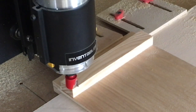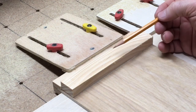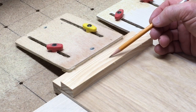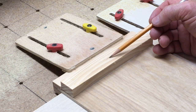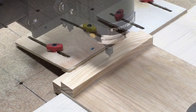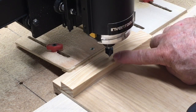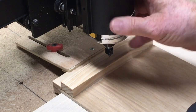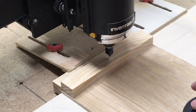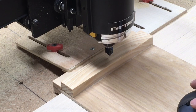I now have a clean slate to work with back at the very beginning. I marked the center point and this is going to be my XY zero point for carving out the letters. I went ahead and moved the spindle right over to my XY zero point — so this is actually set. I'm going to raise the spindle up and go ahead and start my carve checklist.